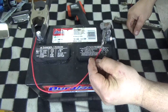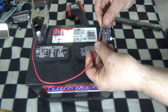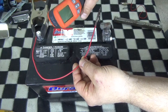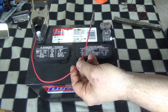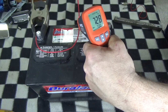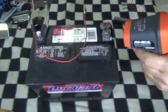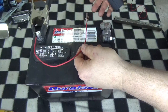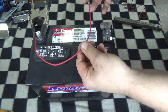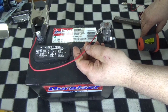I'm going to do it for the sake of our experiment. I have a standard 14-gauge wire here, and when I touch the two battery terminals together, this is going to get really hot. I have an infrared meter, and I'm going to see how hot this gets. Right now this wire is about 72 degrees. I won't be able to hold it on there long — a second at the most — and we're going to see how hot this gets in a very short period of time.